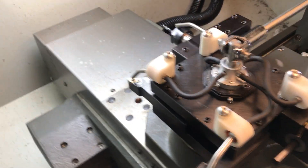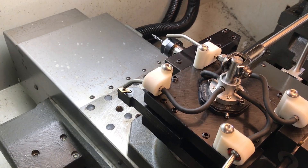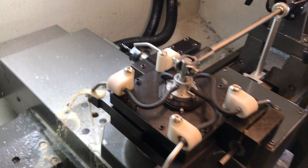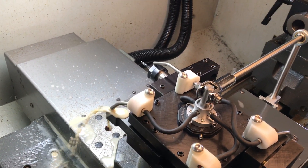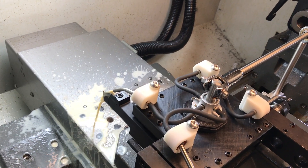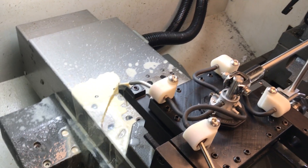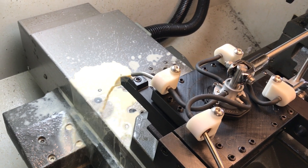Let's take a look at this working in action. Here's a typical setup with a typical cutter. When the coolant comes on you can see it go to that station, but it does not go to any of the other stations. I can index the turret — let's go ahead and index — then coolant back on, and now it's directed only to the station that you want and not to the others.